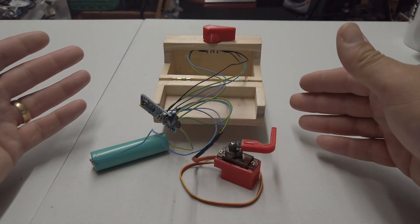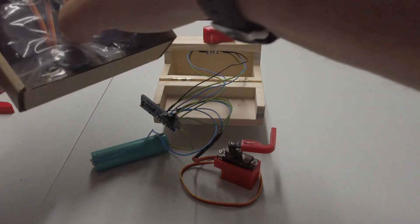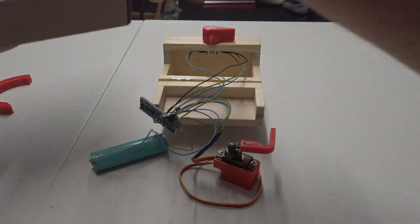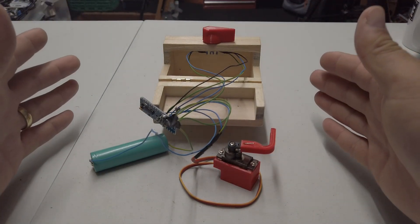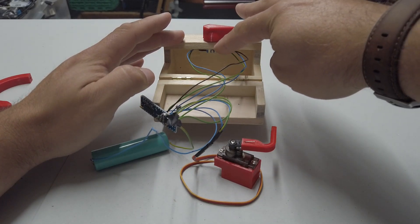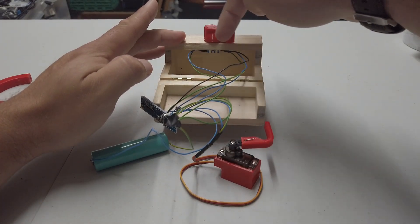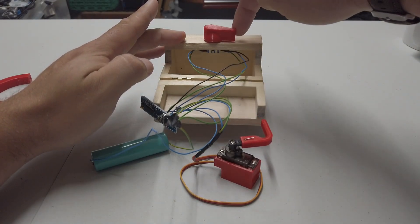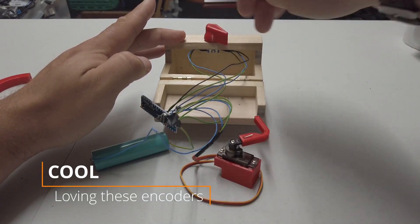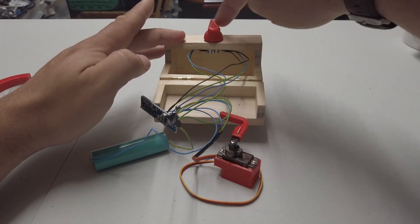Put them in the bin then. So I ordered some slightly higher-powered servos, but these were just a little bit too big to fit in the box. So I've gone with a different method — I've fitted a digital quadrature encoder in here. And hopefully as you can see, when I rotate this encoder, this servo now understands the angular position of the encoder. Sort of cool, right?